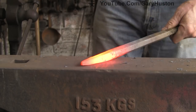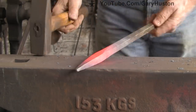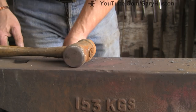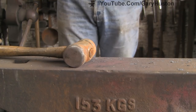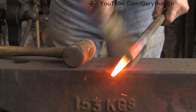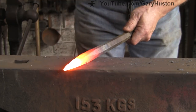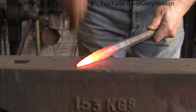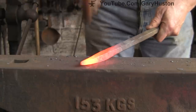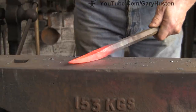You can usually tell if it's going to be good steel by what it was used for in the first place — like these breaker points, you know it's going to be pretty good steel. Half shafts from trucks or cars, again pretty good stuff. I've made many a tool out of a lump of half shaft in my youth — not these days. So you can find all sorts of useful steel kicking about; you just have to think what it was used for originally.